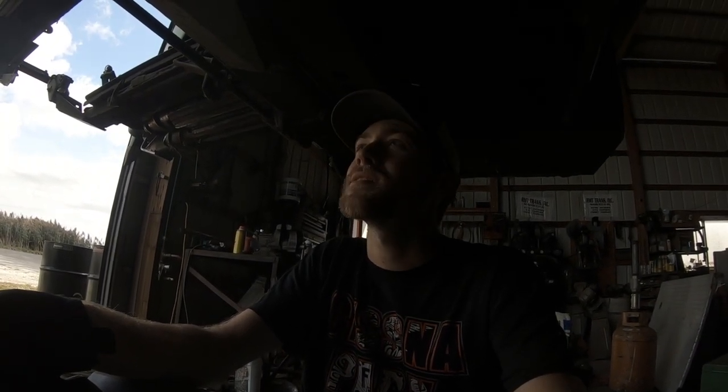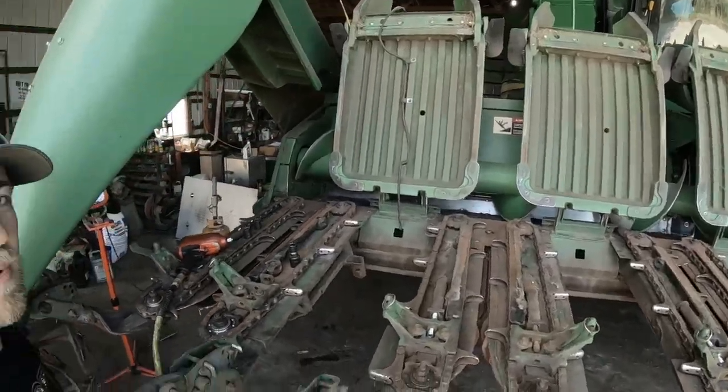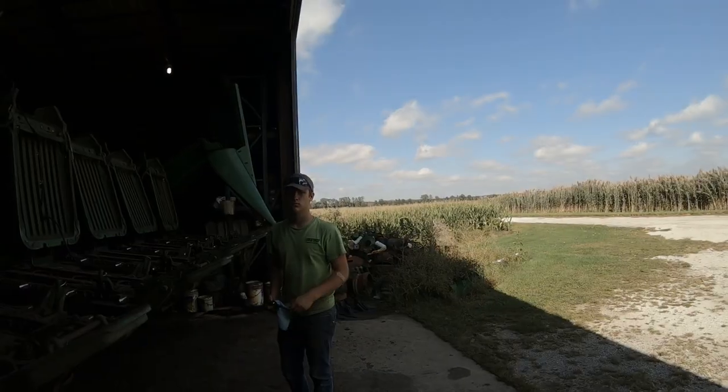So right now I'm filling the gearboxes with grease. It has to be done every year because they get heat and it evaporates or disappears somehow. So you have to fill them back up with grease. Gearboxes are greased. Just have to put this last chain back together. You got all the caps on? Yep. Dylan got all the caps on.